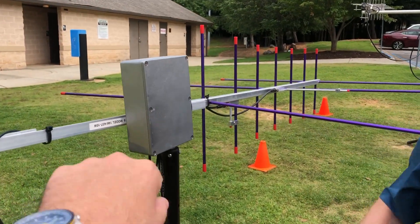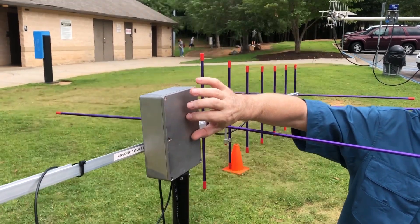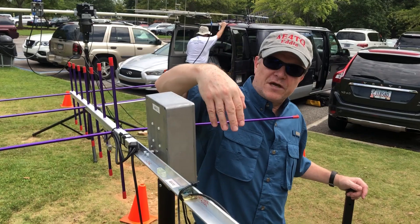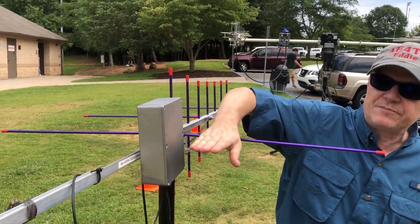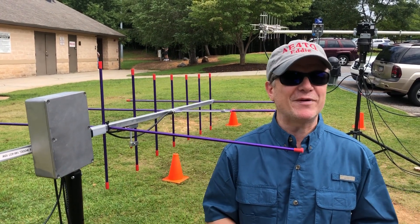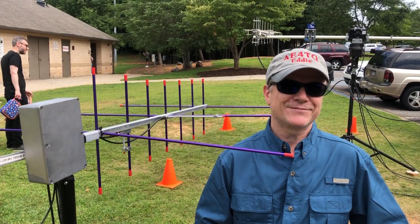You built this controller? Yes, I built the controller. In the box there's a little microcontroller, a little motor interface that takes TTL to 12 volts, which operates the two DC motors in here — one for azimuth on the pole and one for elevation. You select the satellites you want, make sure the time is synchronized, turn on the interfaces and it will basically do the rest. You can just select the satellite, select frequency, and make the contact.